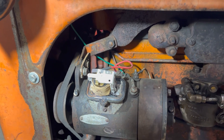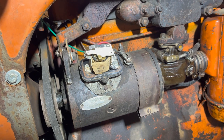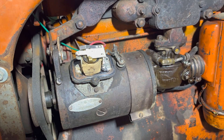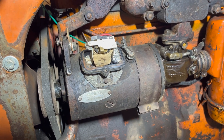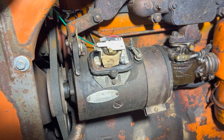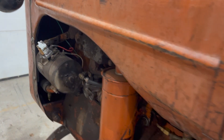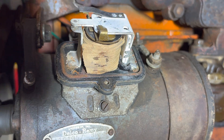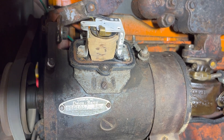But it turns out, after doing a little research, I was just flat misunderstood what was going on here. This is really a voltage cutout relay. If the tractor's running, that circuit is closed, and when the tractor stops running, it opens up. We'll demonstrate that — the coil is pulling that closed, that circuit is closed.